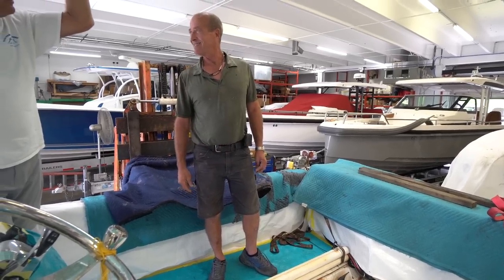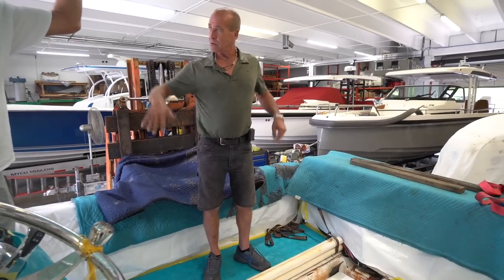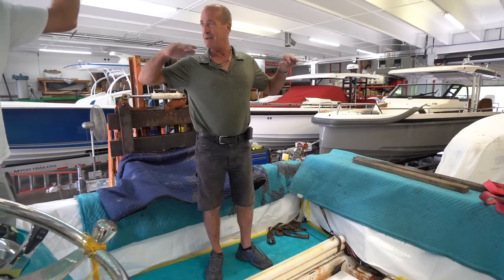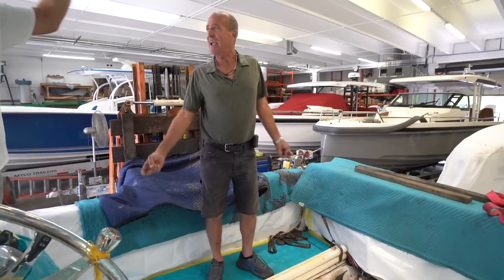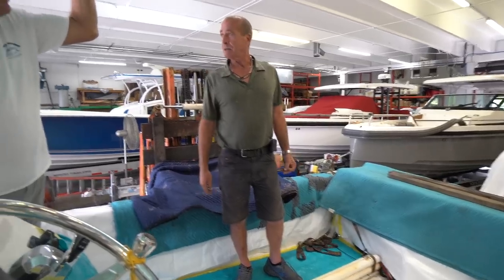What we'll be doing is we'll just put a little bit down so it gets underneath the tank, creates a dam without lifting the tank. Right. And we'll pour it again with a little bit just to make sure that we get a dam and it doesn't go all underneath the tank. Because if it went under it, it would lift it. Yeah. And you don't want that.